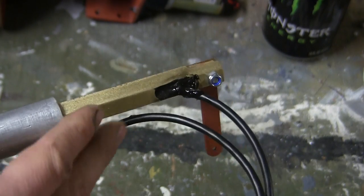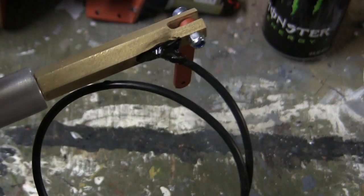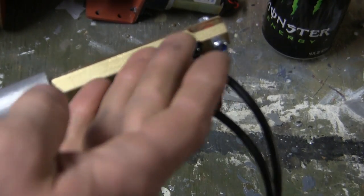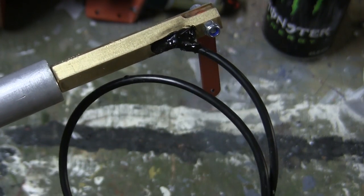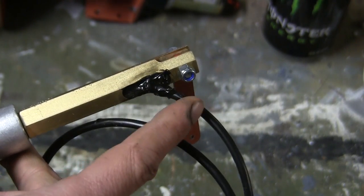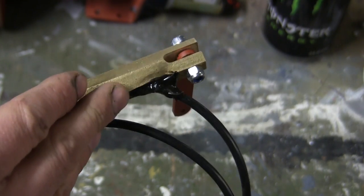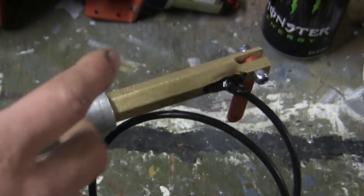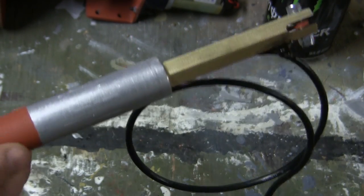This same procedure I can also recommend for anyone who is working on 1/16 scale Tamiya or even the Henlong or Taigen flash units, as they have a very similar system and can possibly have a similar occurrence happen with the photostrobe moving along the barrel during the recoil. Like I said before, I use black silicone to anchor the cable in place. Hot glue is another medium that can also be used for the exact same purpose on both the 1/6 and 1/16 scale vehicles. Other than the silicone, the rest of the assembly is all out of box Armortek with no mods needing to be made.